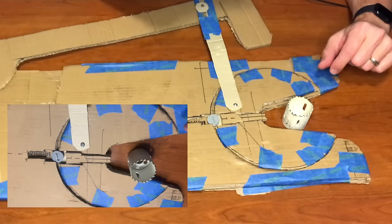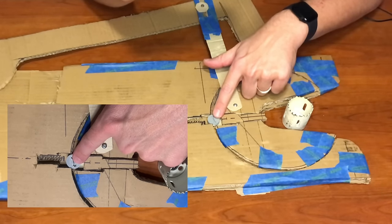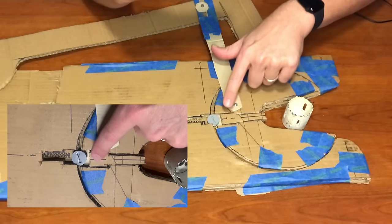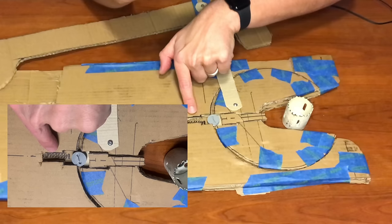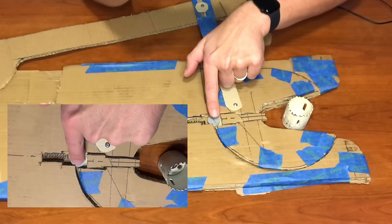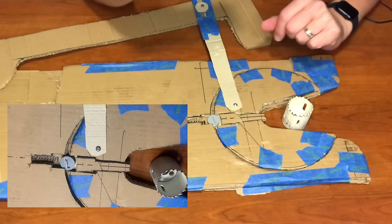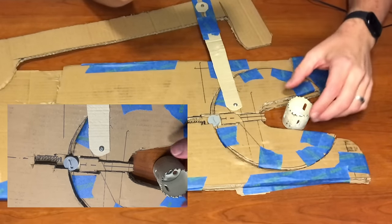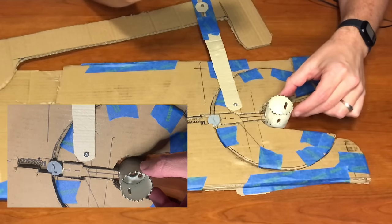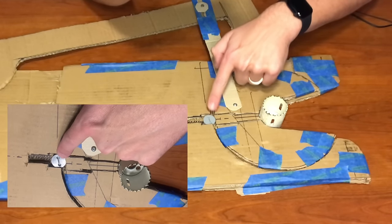For the purposes of this cardboard catch wagon, this is a ball bearing, essentially, that's sitting inside there. It's about 25, 30 millimeters in diameter. It's pretty big. And on this side right back here, inside the head, this is just a spring pushing on the ball bearing. And this side over here is mechanically bound up, so it has nowhere to push that bearing. So what happens is when the axle comes in and finally connects, it pushes on that button right there and pushes the ball bearing out of the way. Not completely, but just a little bit.